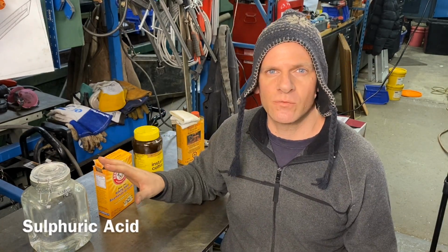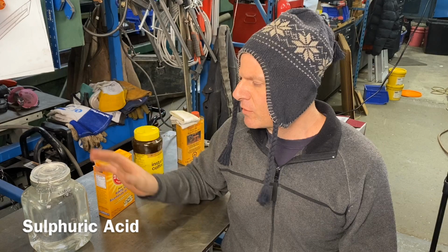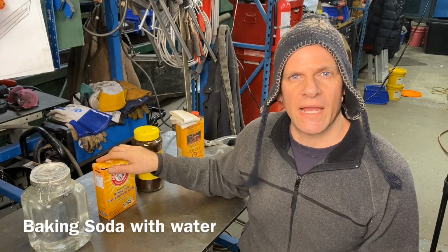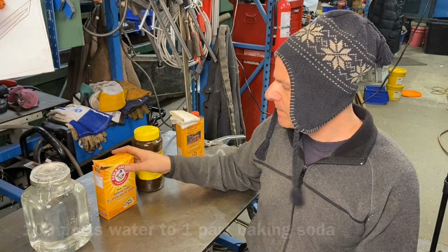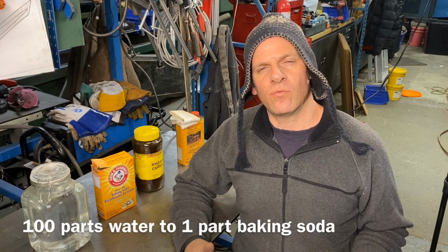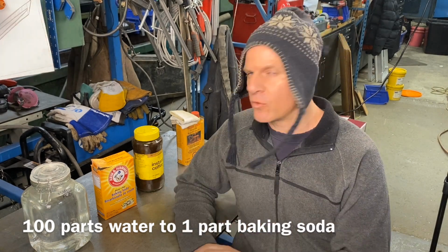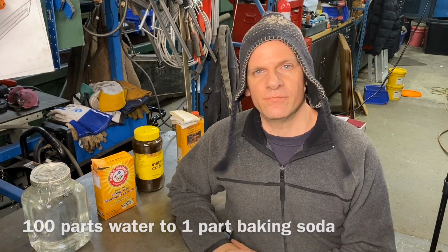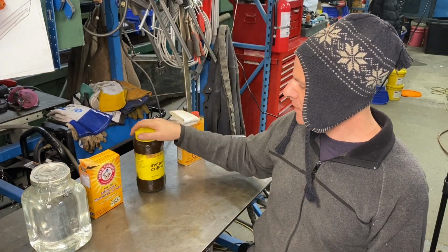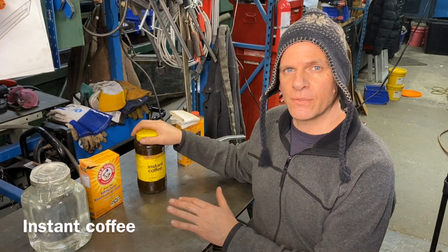We're gonna need a type of acid. So I use sulfuric acid, so battery acid works, and you can also use ferric chloride. We're gonna wanna use something to stop the reaction after the acid, and I use baking soda. And I'm gonna get a pail of water, and I'm gonna put about a quarter of the box of baking soda inside that pail. After that, I stop the reaction.